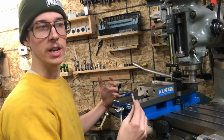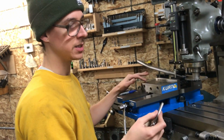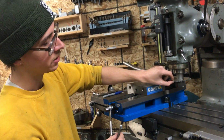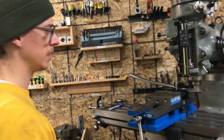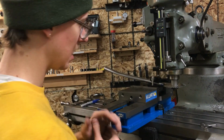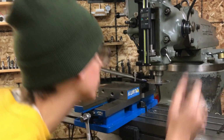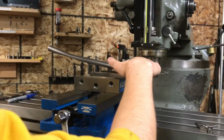And so if I'm always getting them loose, then I know, well, actually I shouldn't go to my full depth right away. I should sneak up on it. And you learn by doing it exactly what size your cutter will cut at. Depends a little bit on how sharp it is, and also whether or not it's the nominal size. But anyway, so I'll set up the cut something like this,